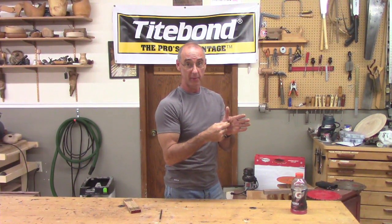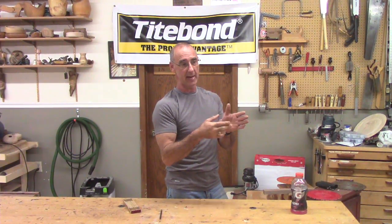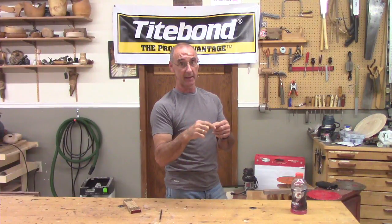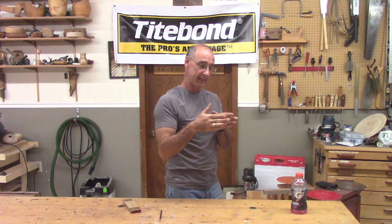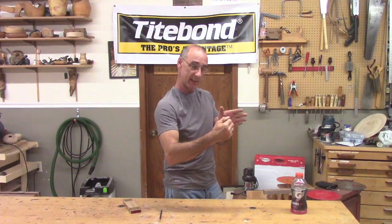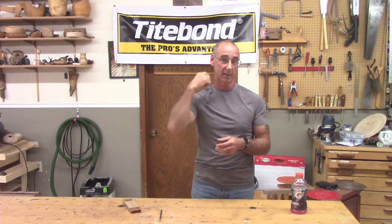So you've got to make your router fence into what's called a zero clearance fence. Basically, you get your setup exactly right, so you know the joint is the right fit and the bit is the right height. Then with the bit running, only on the infeed side, you loosen that fence face and push it into the spinning bit. The fence face now completely surrounds the cutter, so as your material's feeding across it, it can't blow that face out on the infeed side. But I'm confident that we have a video on that, and I'll put the link to that in the answer to the question.